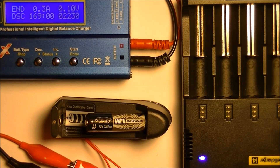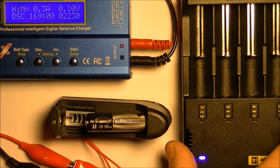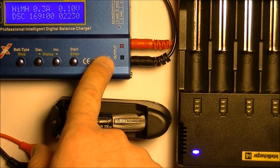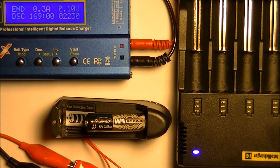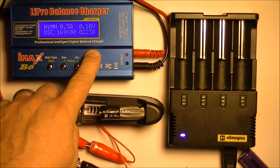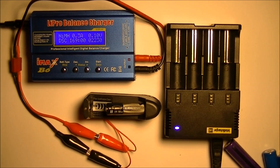And that's my little video on checking the capacity on your batteries. If you have a lot of batteries like I do and you use them in your flashlights and various other devices, I highly recommend that you get this equipment — the Nitecore i4 version 2 charger and the IMAX B6 LiPRO balance charger. Note that the IMAX B6 comes without a power supply; you have to supply that yourself, and it should be a 12 volt supply. I'm using a 5 amp laptop power supply and it works great.